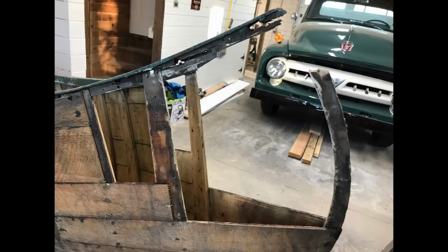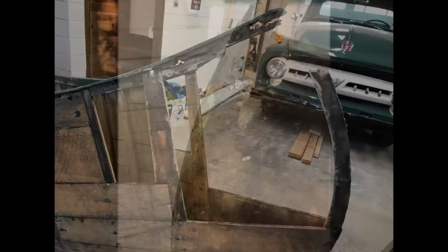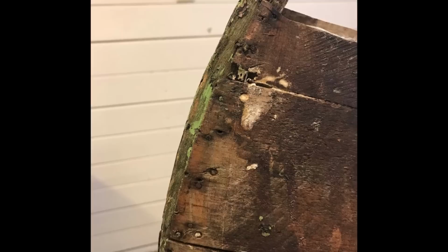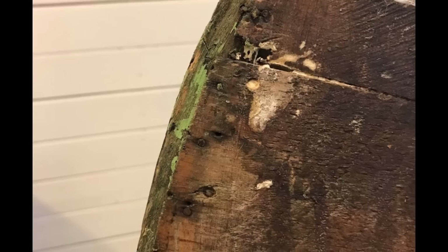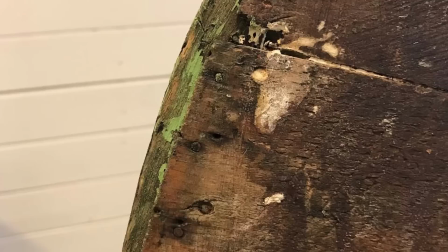As a side note, the planking on the port side at the bow stem was short and didn't reach all the way to the leading edge. The starboard side was fine. Because the planking was short, there wasn't enough room to use the copper nails employed elsewhere. They used light gauge steel nails that extended through the planking and the stem and the planking on the opposite side, and then simply were bent over. There's no indication that this was a repair done years later after the canoe left the factory. It was original to the boat.